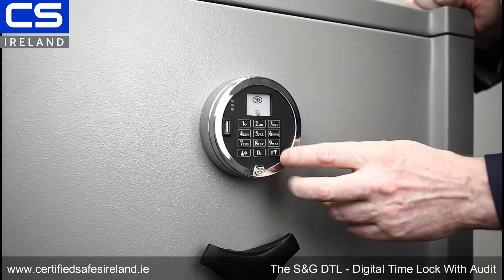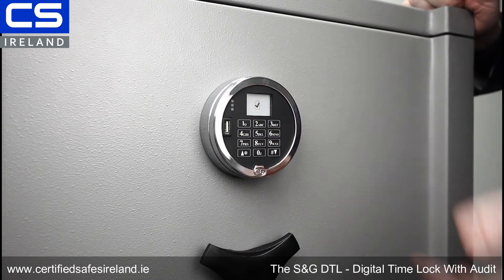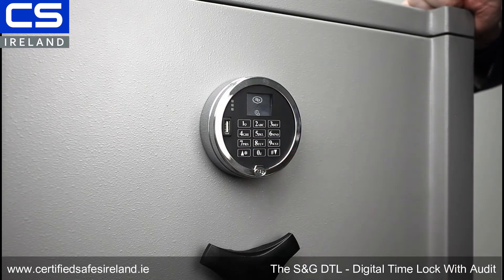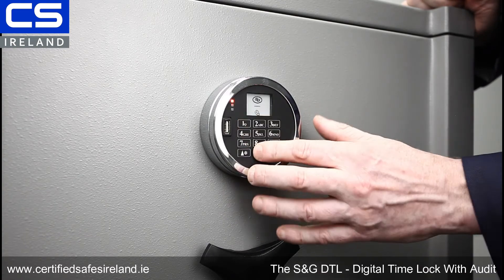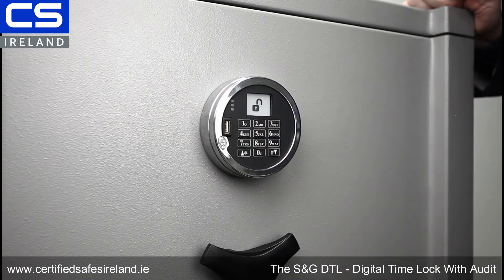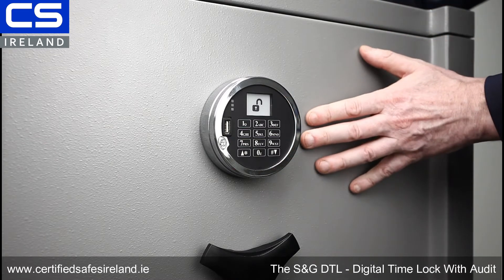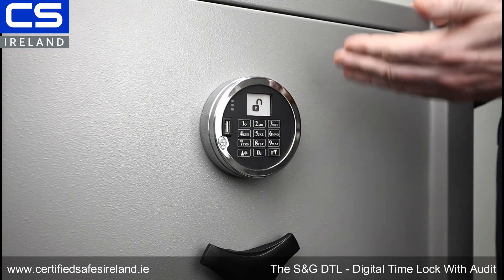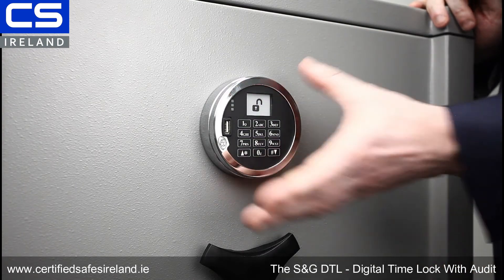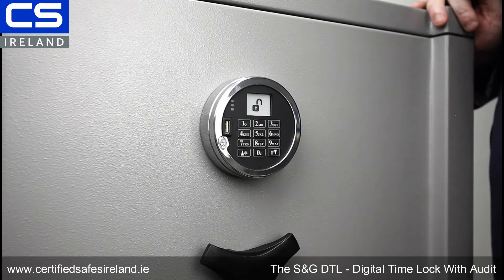Now to show you some of these symbols — pressing 96 star shows the power level symbol. You can see we have full power at the moment, but it will also show you if you've got half power or need to change your battery, and it will tell you this in English on the screen. If I open the safe now, you can see the open symbol — you could view that from across a room. E-ink doesn't use power when it's just showing a display; the power is only applied to change the display. So I could take that keypad membrane out of the lock right now and that symbol would still be on it.